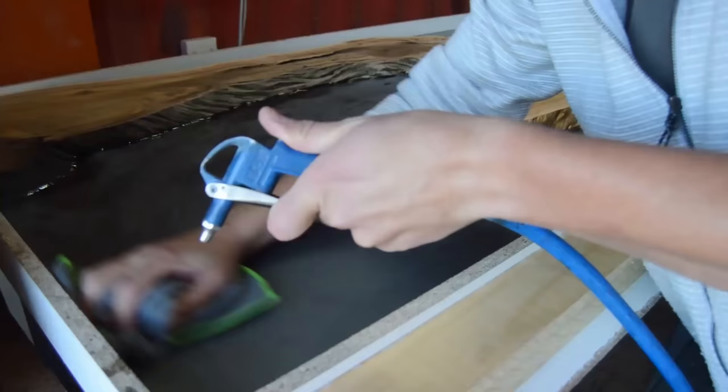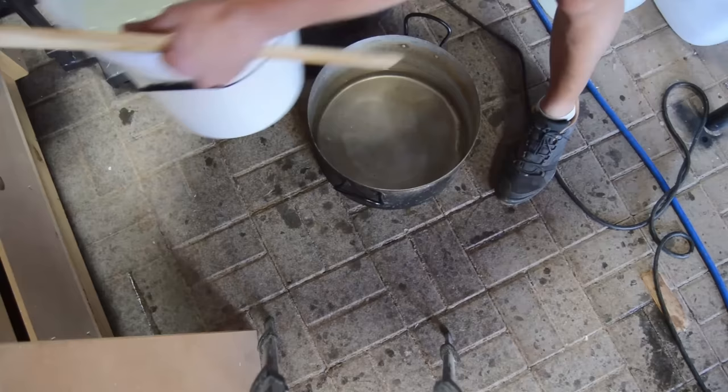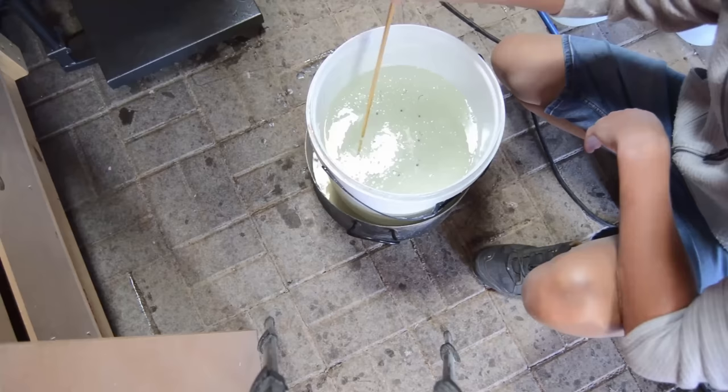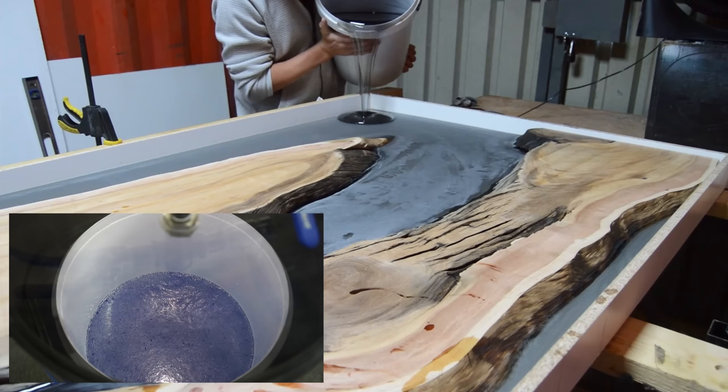You have to make sure you remove all dust particles. The next step, which we still use today, is placing the epoxy in a big drum and warming it slightly before casting. This helps the epoxy become more liquid and allows most air bubbles to come out. We also recently invested in a vacuum chamber that removes all the air bubbles from your epoxy.